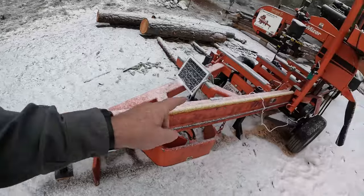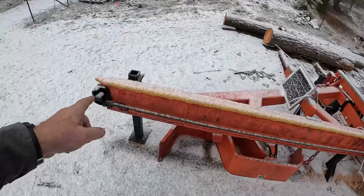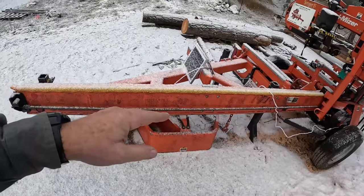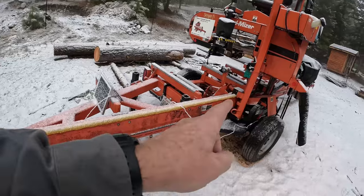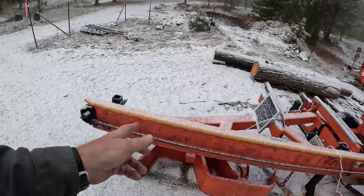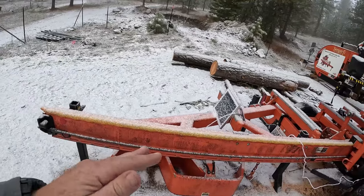This is one-inch split duct and it fits right over the sawmill rail, which prevents that top rail from developing much rust. I don't actually cover the chain or the bottom rail. My thought on the bottom rail is that water drips off of it, and if it's oiled up really well it does just fine. Same with the chain — it'll build up some snow and even ice, but it tends to melt off during the day, and I have it oiled up really well with ATF.